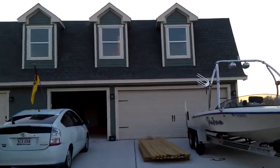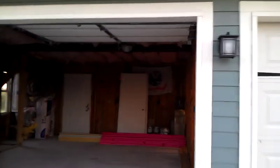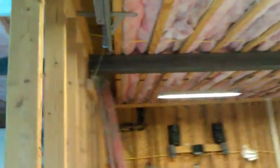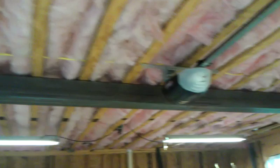Had trouble with the joists supporting the second floor — deflection and bow down was causing it to be a bit too weak to put in a pool table. We put in i-joist 360 at 12 inch on center, but the bow down and the flex was a bit too much.